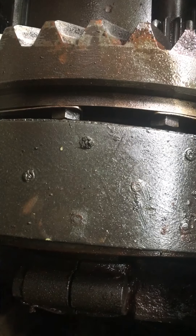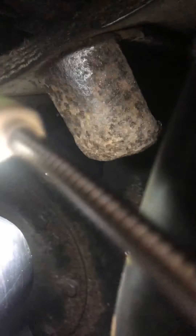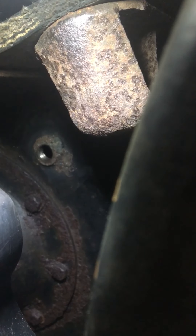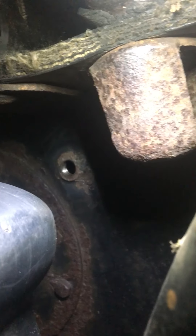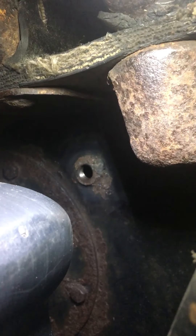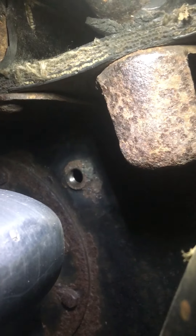So they have a little plug that you can open up on the side wall to shove it through. You can see it down towards the left — there's a hole there. I've removed the plug to give me the ability to knock that pin all the way out. The plug, unfortunately, has an Allen head or hex head indentation on it, which is a little bit hard to work with. You have to kind of burrow your arm in there and try to pull it out. I heated it up with my torch around it and used liberal penetrating oil, and finally it cracked open.